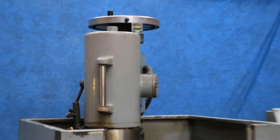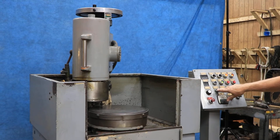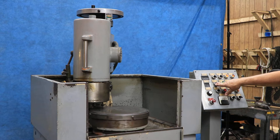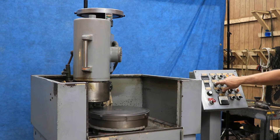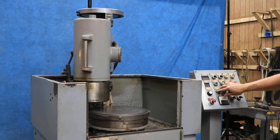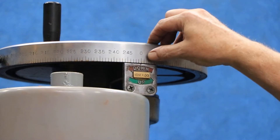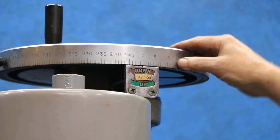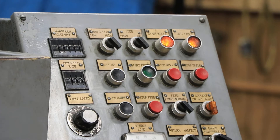It goes quicker than you think, but it also has a low setting that goes much slower. Let's say I put this at zero — that's basically at zero now. Each line is one thousandth; that's five thousandths, so that's ten thousandths. Over here, I've got ten thousandths dialed into this thumb switch and a feed rate of 10 for the downfeed rate.